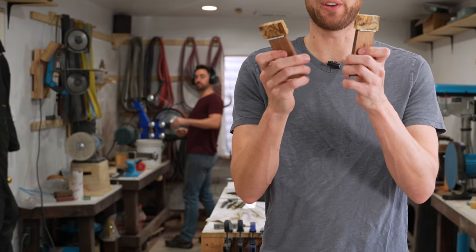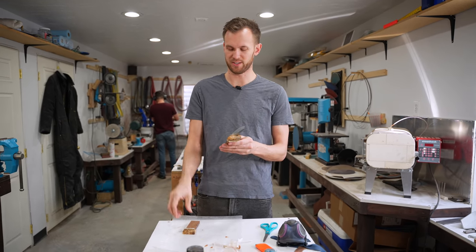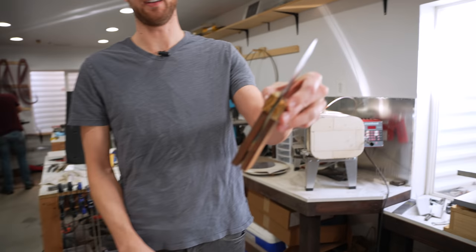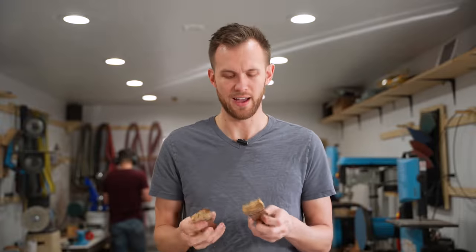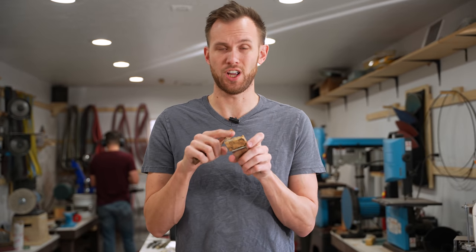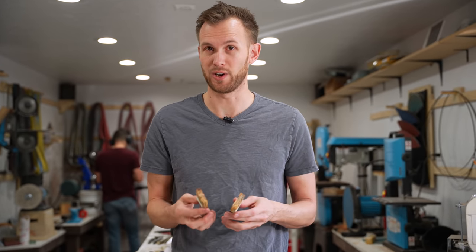Handle pieces are glued up. We've got both of these — these are going to be our knife scales and they're going to sandwich on the knife just like this. If I wanted the world's ugliest knife I could be done right now, but I think I'm gonna shape a little bit. I have to get both of these surfaces nice and perfectly flat so they'll attach well to the knife. I have to drill three holes in each one in just the right spots and add some shape to the front of the bolster area. After those steps are done I can glue it onto the knife and let that glue dry overnight.